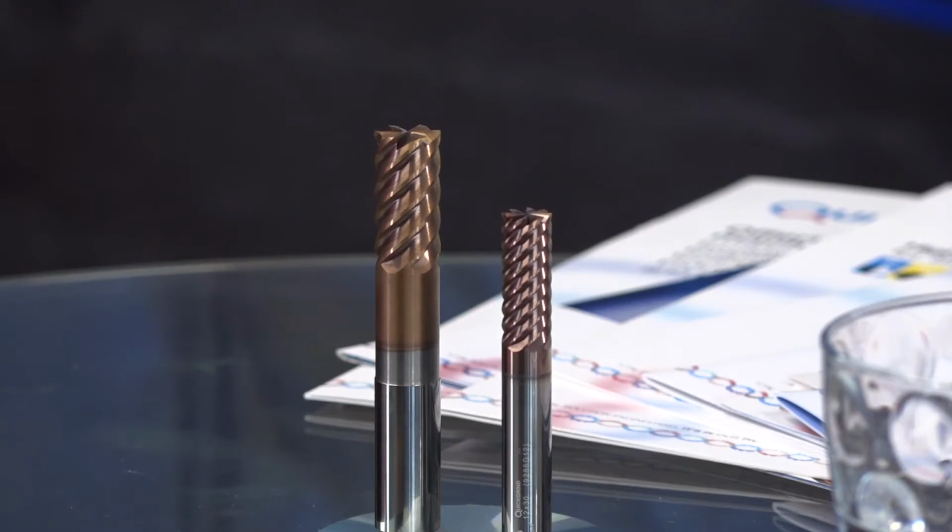And this is a standard tool from Quickgrind? It's one of our standard ranges. As we always say, we love to make tools for the job, so give us an application and we'll come up with a tool. Sub-micrograin carbide, ground on your ANCA machines, X-red coating. Generally X-red on that. Sometimes we'll do MX coating, which is more for the die steel industry. Sometimes we've found that a flash TiN coating on top works seriously well as well. So it depends on the application, the coolant, if there is coolant, and what we're trying to achieve.